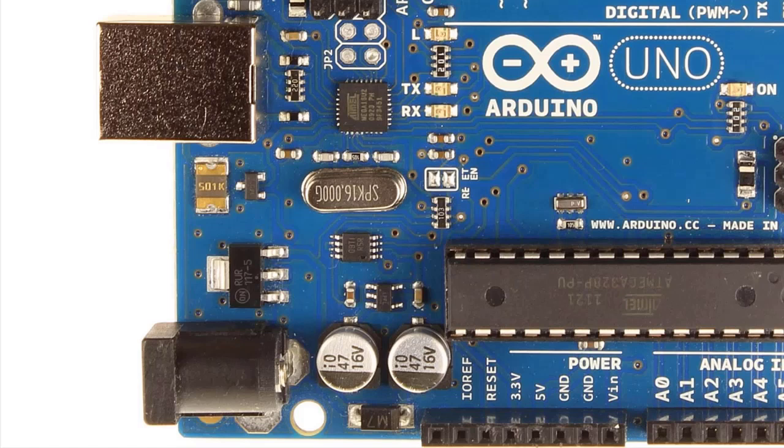If you have a board like this one with the 16-volt capacitors, one possible hack could be to replace the caps with ones that boast a higher rating — say 25 volts. The caps are 47 microfarad electrolytic capacitors, and this could be a good beginner's Arduino project and also a good insurance policy on your board.